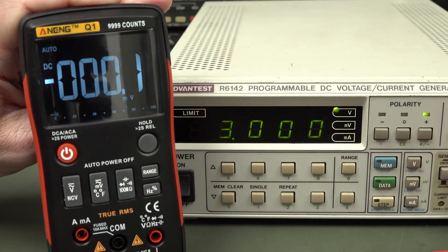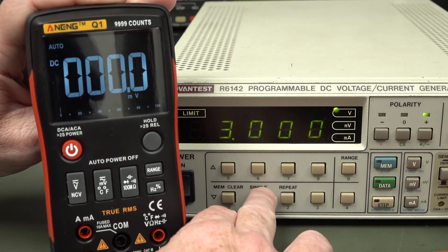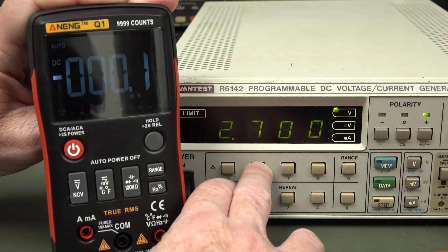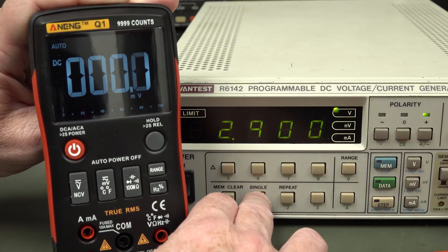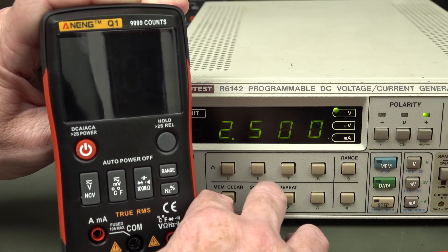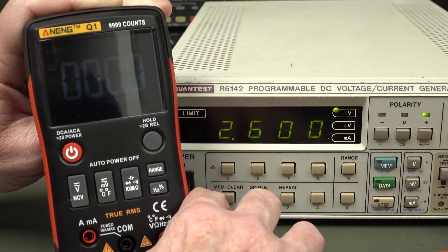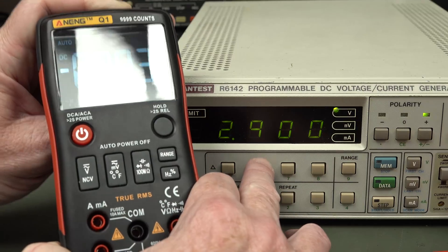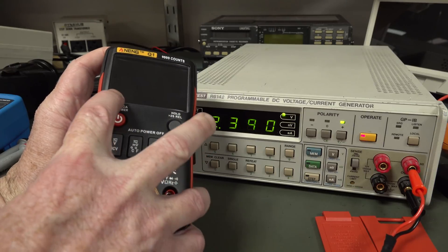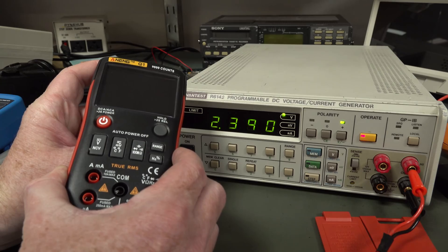Now let's see what the dropout voltage is. Look — the brightness of that display starts dropping at 3 volts. Look how the brightness drops at 3.5 — sorry, 2.5 — it's gone. This thing is hopeless. Absolutely ridiculous. It cannot work. That is ridiculous — that's 1.25 volts per cell that it should still work at. You've got to have 1.4 volts per cell at least. I don't even see the battery indicator. Any low battery indicator is useless because the bloody display doesn't work. Turn-on is at just under — let's call it 2.4 volts. Bloody useless.